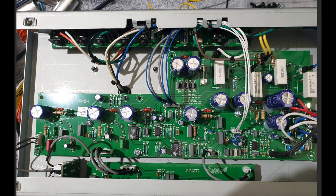All right, so here is the board with all the mods in. So here's the first coupling cap, the new cathode setup for V1B, the 22 microfarad fat cap on the third gain stage. There's the 470 picofarad on the 100K cathode resistor for the cathode follower. And finally, over here is the fixed depth 220K resistor with the 4.7 nanofarad, and it looks like, if I can read that correctly, R20.